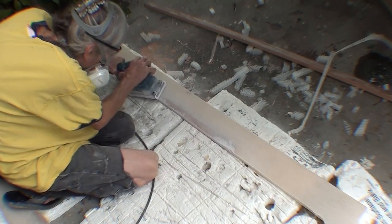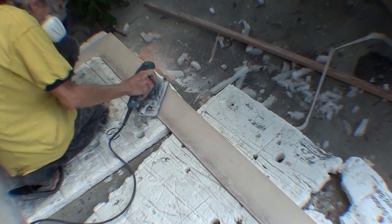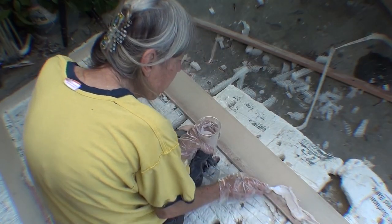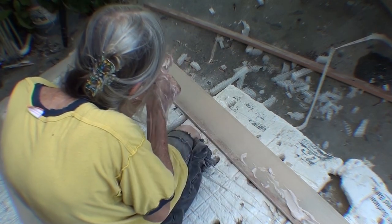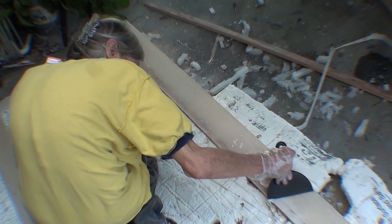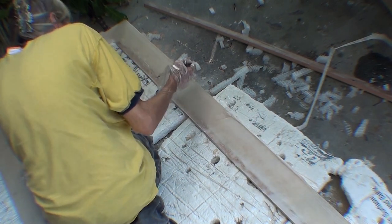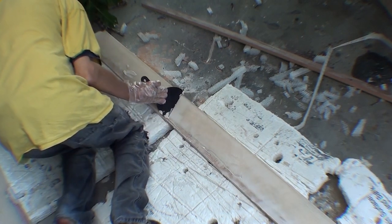And I'm also doing fairing compound and sanding on the faces of the panels to correct a little bit of damage that was done when I cut off the core. Fairing compound sort of smears in like cake frosting, and then you have to try and smear it flat with this spatula thing. I'm not very good at it, so I usually have to do a pass, sand it, and then do another pass and sand that before I get it flat enough for my liking.